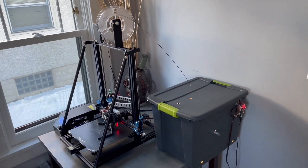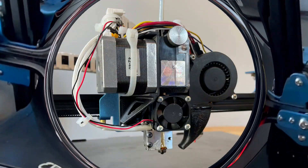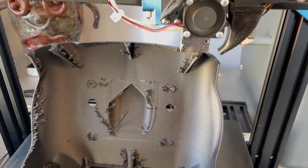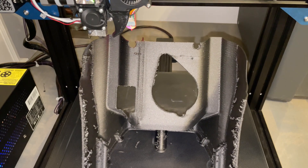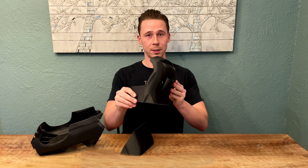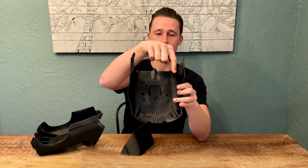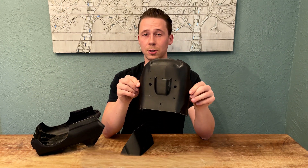Finally time to start making parts. I'm using a CR10V3 modified with a Volcano hotend so I can fully melt composites with a hardened nozzle, and a PT1000 so I can print long-term at 300°C. It took about 30 hours and half a kilogram of material to print all three parts. These were all printed at a toasty 300°C without an enclosure. I annealed each part in the oven after printing. The printed parts look phenomenal. The front piece outside looks amazing. The inside is not quite as amazing — there's quite a bit of stringing and goobering in there. Since this is a U-shaped piece, you're able to keep most of the travel moves restricted to the inside, which keeps the outside surface pretty string and goober-free.